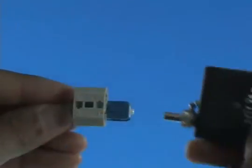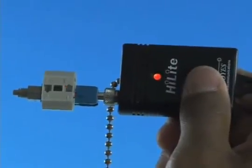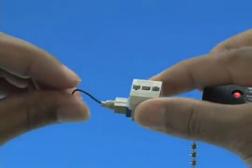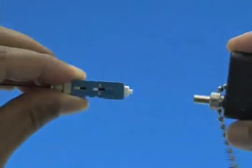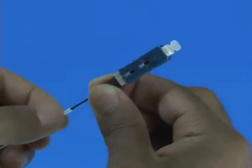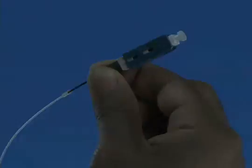Option B: Termination using a visual fault identifier. Remove the dust cap from the fast connector and insert the connector into the VFI. Turn on the VFI — there will be a red glow in position one of the wedge clip. Insert the cleaved fiber into the rear of the connector until the red glow dims. Make a bend in the fiber to maintain connection. Squeeze both sides of the wedge clip to release the wedge and discard the wedge clip. Remove the VFI from the connector and place the dust cap back onto the connector. Slide the 900 micron boot onto the connector. Slide the clear protective tube toward the connector and attach it to the 250 micron protective tube. Termination is now complete.